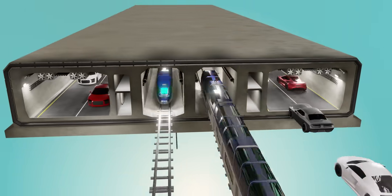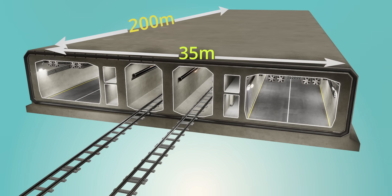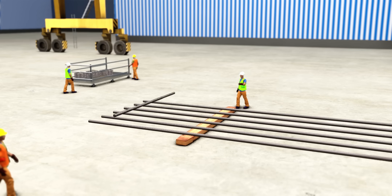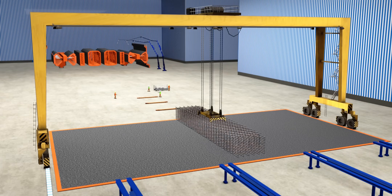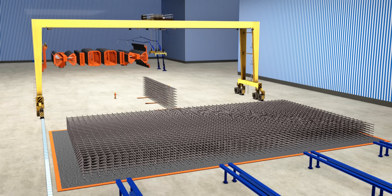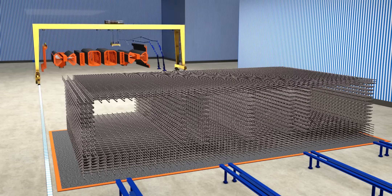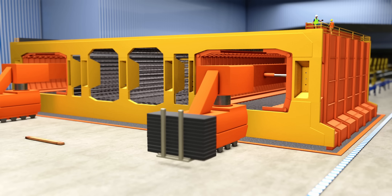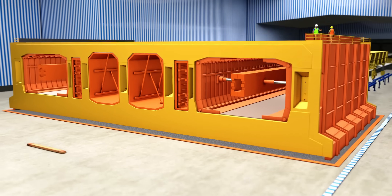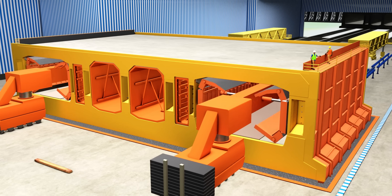The geometry of these gigantic concrete elements is sophisticated and interesting. How are they fabricated? How are they transported? Let's visit a concrete casting facility in the harbor. This area can be a purpose-built basin, or an existing dry dock is prepared near the water. They use reusable formwork, and a huge amount of scaffolding and support is needed to support these forms. Some forms are even hydraulically powered. Once the rebar and form arrangement is complete, the concrete is poured into the cavity. Once the concrete is cured, the forms are removed.